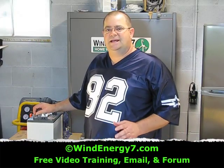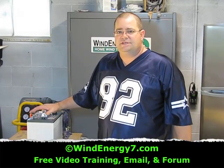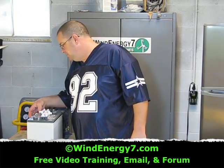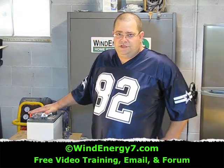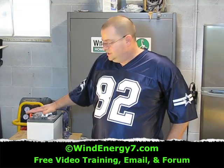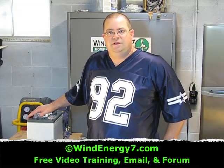The specifics of batteries are voltage. These are 6 volt deep cycle, and this is a 232 amp hour battery. If you go to replace this with a 210 amp hour battery, it's not a good thing. You need to maintain the same kind of amp hour — the same spec in your batteries. They need to match.